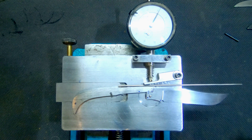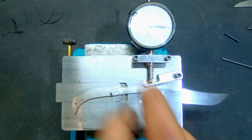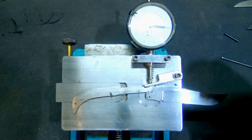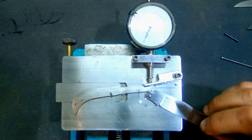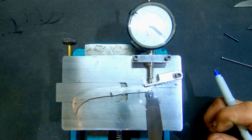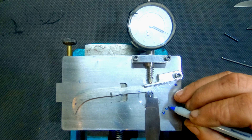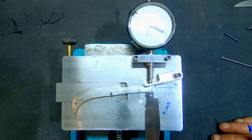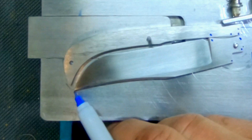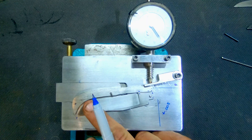The initial goal is to try and set zero in the open position and mark that. I don't want to make any adjustments to that because that's going to be my base of operations. Then at the half stop, I can adjust this to where it ends up where I want it to be — and it happens to be there now. So I'm going to mark that one as plus .005. I also want to make sure that there's enough room for my tip to clear, keeping in mind that the spring will be in a different position in the knife handle.